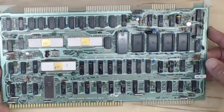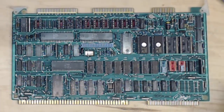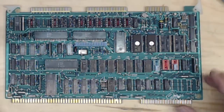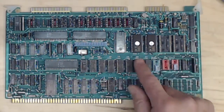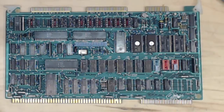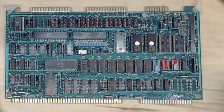The Multibus standard evolved a bit. There was the 8010A, an 8080 version, an 8086 version, and the 8010B. This is an 8010B and it's my favorite card to play with. It still has an 8080 on it — the 8080 and 8085 are my favorite processors. There are a lot of improvements: we've gone from 4K of ROM to 16K of ROM. Even better for us nowadays, this uses the 2732, so we can buy a 2732A EEPROM for a couple of bucks and have a whole pocket full of them when programming this board.